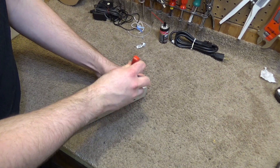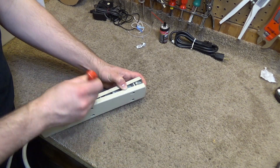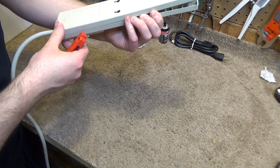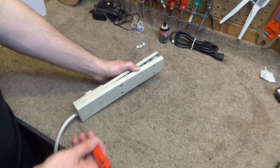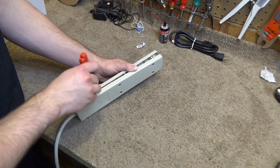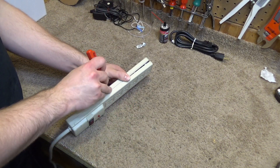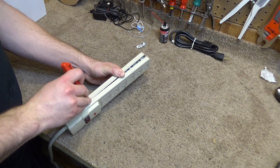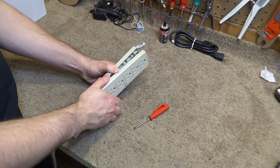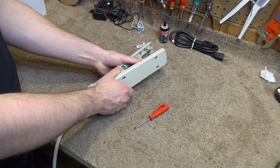What happened is that for a very long time I've plugged a heater into this power bar and would turn the heater on and off with the bar because the heater doesn't have a switch. This bar is rated for 15 amps, as was the outlet. The day it quit, I had the heater and the computer both plugged in — a use case that very seldom shows up. I tend to think maybe I put too much power through it, but 15 amps is the capacity of the outlet itself which has other things connected to it. I don't think the heater plus the computer equals 15 amps — the circuit breaker should have tripped if that were the case.